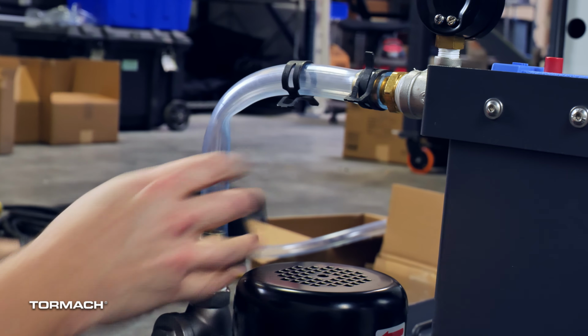You will need to disassemble this by removing the nuts with a 2.5mm hex wrench. But there are O-rings inside that need to be kept in place. So rip off a couple pieces of masking tape and tape the washdown block together so that the screws can be removed. Align the Y-axis washdown block onto the Y-axis rear way cover and secure with the screws you just removed.